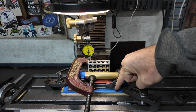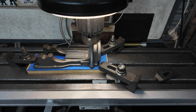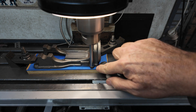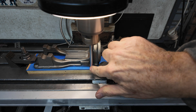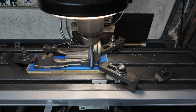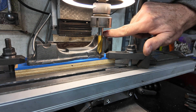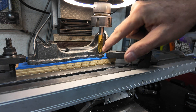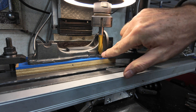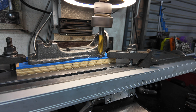Now we've just got to line up these holes and drill them out. I've got the drill chuck here and this piece of rod — it's pretty straight rod. Turn it on and you can see it's pretty much bang on lined up with that lug there. We'll set the DRO on that and then set up for the other one. This end we've run into clearance problems with this flange here, so I couldn't use my end mill. What I'll do is use this carbide short drill that I've got — it's a countersink-type drill — and I'll just use that as a center drill, just to make a little start for it.